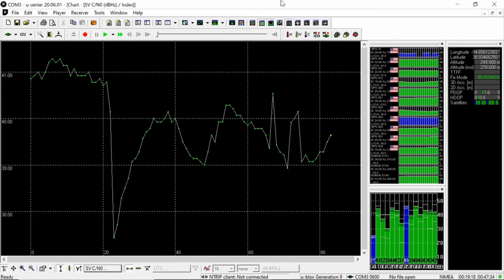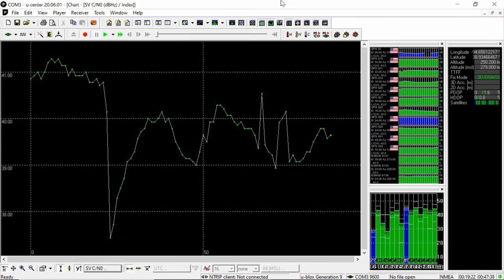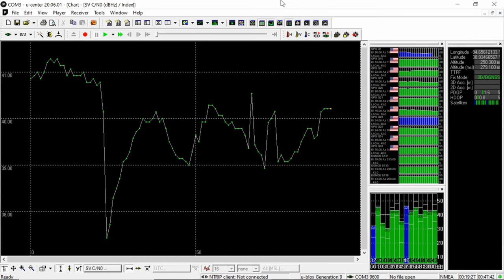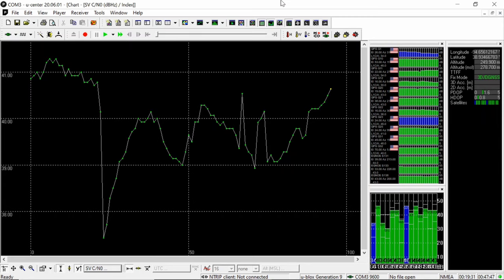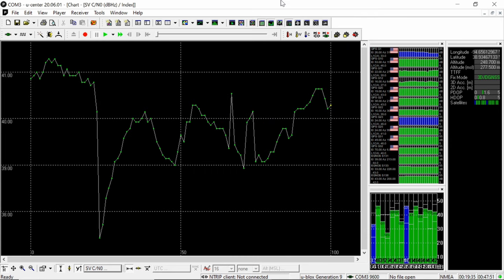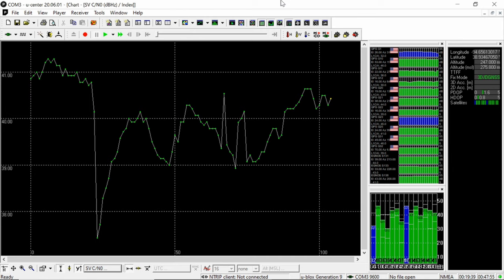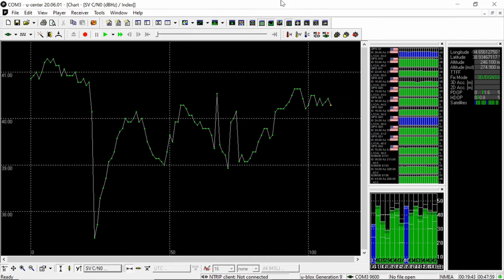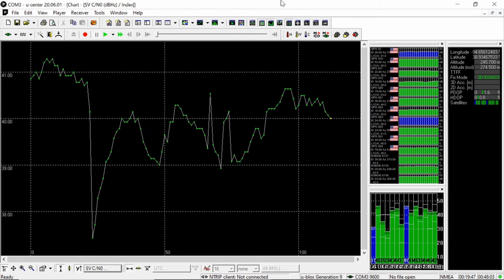All right, I've got the antenna outside now hooked to the GPS module. It's got a C/N0 of almost about 40 dB. The C/N0 is the carrier to noise density ratio, so above 40 is pretty good. Typically, that's no problem getting cold starts in under 30 seconds. Typically you want to be in the high 30s or above 40, not below 35 really. It's really marginal there, but this antenna seems to work very good.